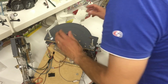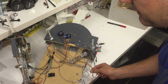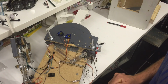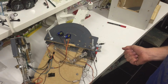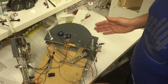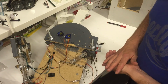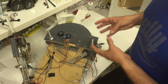Yes. And did I mention a lot of things coming loose? I don't know if you saw that, this one saying hello here. That's the potentiometer for the first officer's side, handle number 2. That just came loose like half an hour ago. Like this one, and that's of course supposed to be in place. I've used hot glue for a lot of things in here, and that might not be the best of solutions. Hot glue is good for panels, because inside a panel nothing is moving, but inside a throttle here there's a lot of things moving, there's a lot of power being applied, and things will just come loose. These switches for the fuel cutoff switches have come loose a few times, and also other switches have come loose, and I've needed to remount them. So make sure that you mount things properly the first time.